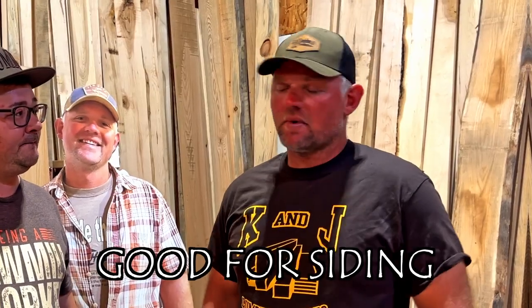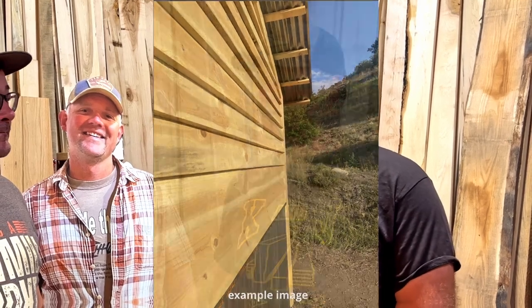For exterior projects you can use a lot of rough-sawn. People call me all the time asking if they can use fresh-cut green lumber for exterior projects. On my own houses I've sided three houses and a cabin with rough-sawn pine. I usually air-dry it for just two to three weeks, just enough to get some of the moisture out — pine dries fast anyway — then I stain it and put it up as siding. That works well for posts and similar applications too.